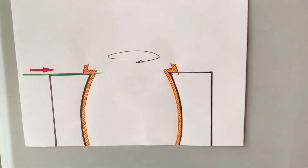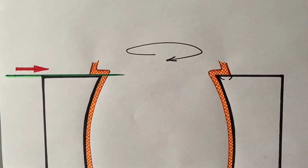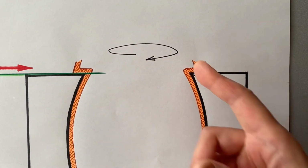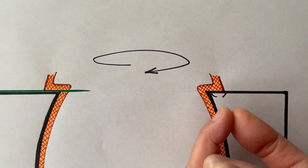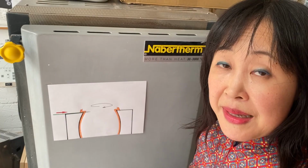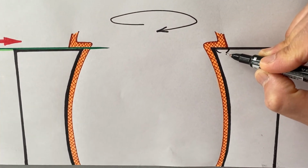And here once again, we insert the knife, but horizontally this time, because this edge will be the rim of the cup, and turn the turntable to cut this excess clay off. If you keep this margin too wide, it will be tricky to cut it off. So I recommend you have about 5mm of margin here.